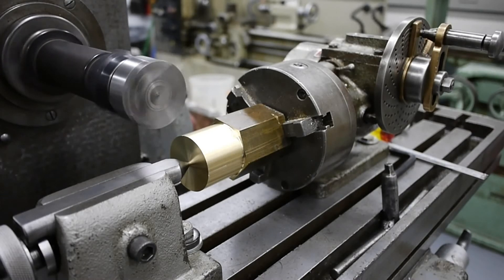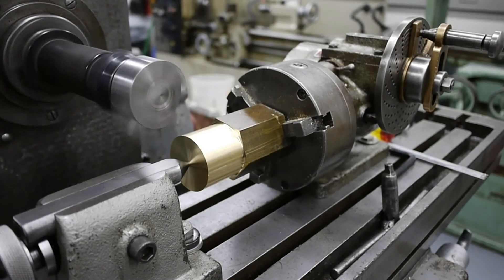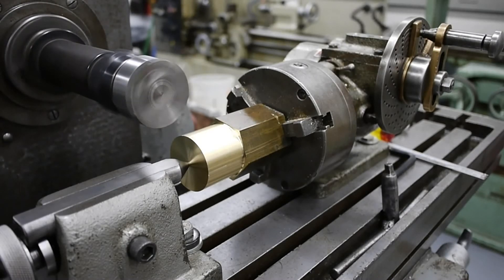We're running at the slowest speed this machine can go right now because it's a one-tooth hand-ground cutter. It's not like a gear where I could run at a higher feed with a multiple-tooth cutter. I'm just going to take it slow so the high speed steel doesn't burn up and the tip doesn't wear out.